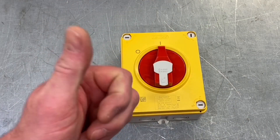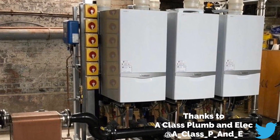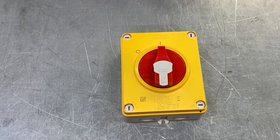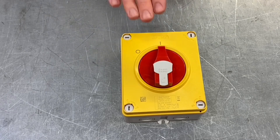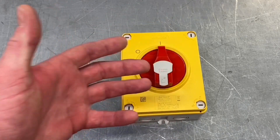As for protection against sunlight and changes in ambient temperature, this will function within a wide range of temperatures — as low as minus 20°C and as high as plus 60°C. That's a very broad operating range. It's also UV resistant. We've all seen plastic items installed in direct sunlight that very soon start to go brittle and become bad news for an electrical enclosure. UV resistance is another great feature.